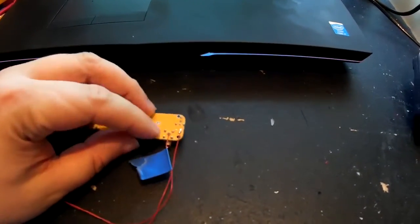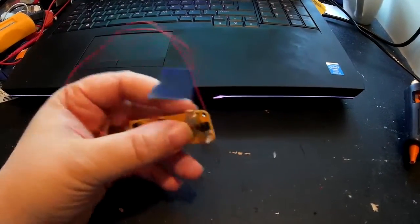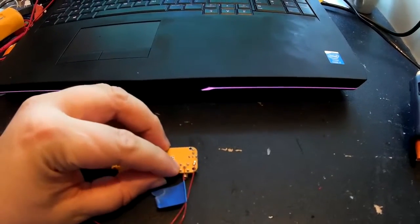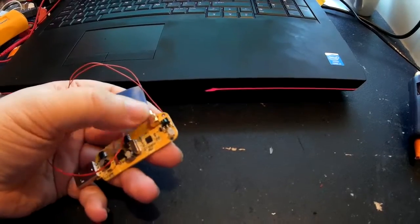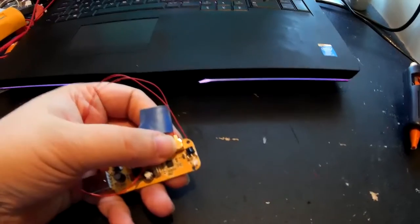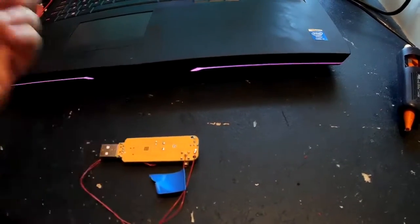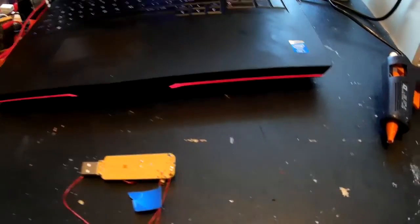Okay, so hopefully you can see I've joined to this connector pins 1 and 2 from here. My soldering iron could barely get the heat up enough so that I could use one of these ground points from this connector, because this thing has a lot of thermal mass, or in other words, it takes a lot of heat to get that up to temperature before you can start soldering to these points, because it just keeps acting as a heat sink, so it kept pulling the heat away. So that was a bummer.